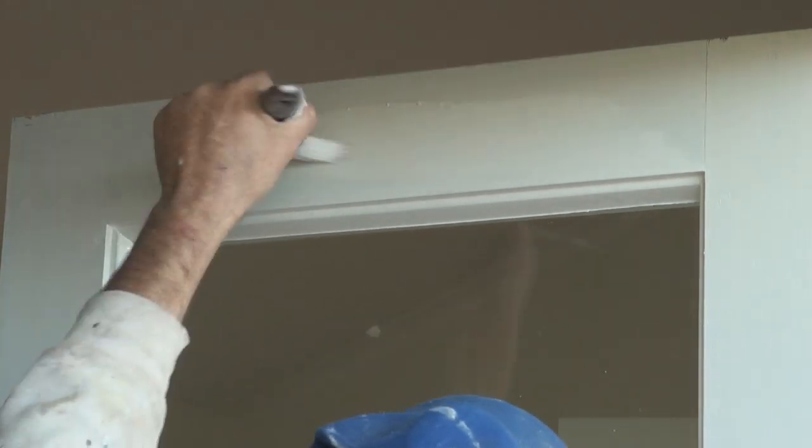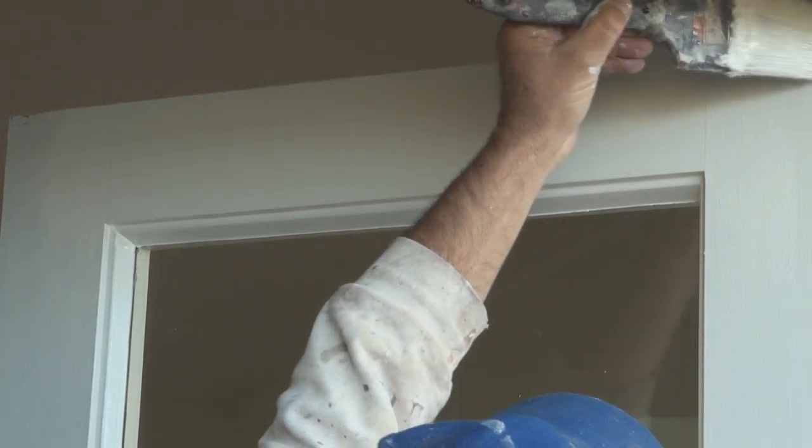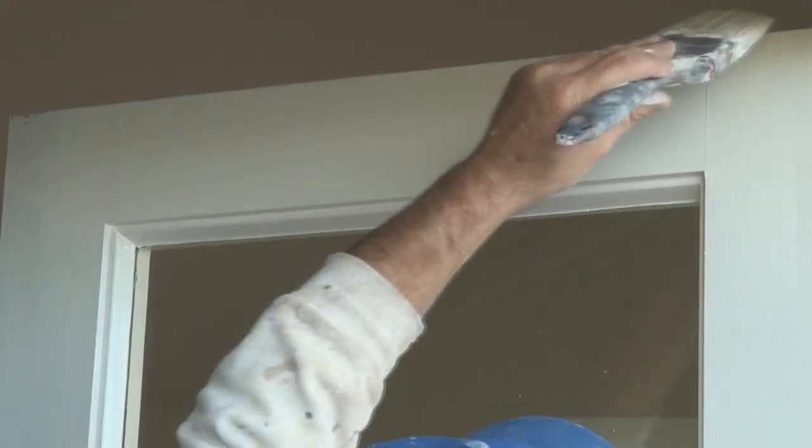Paint the top bit. Now when you finish painting that top, make sure you just wipe these sides down with the grain. If you leave brush marks across like so, they'll stand out, so just bring the brush down slightly. So when the top bit's done, we'll do the centre.